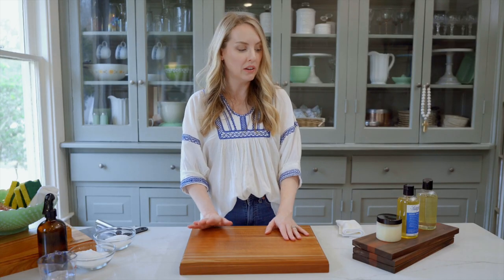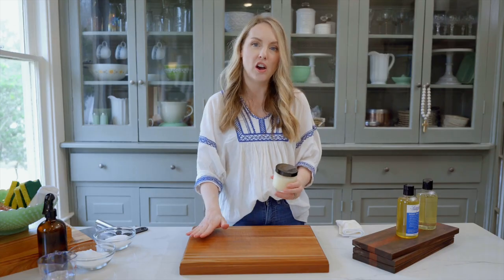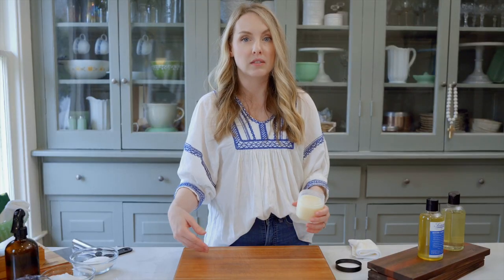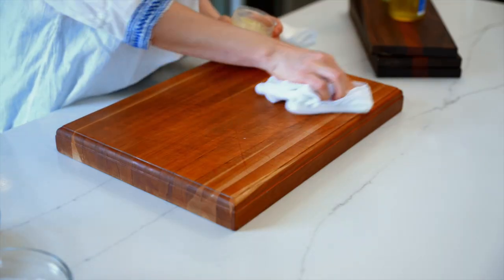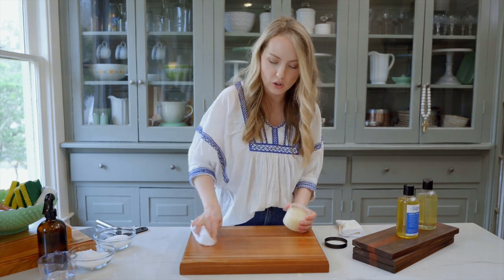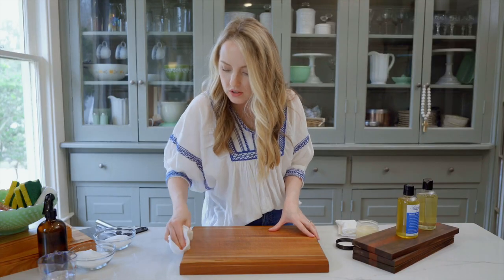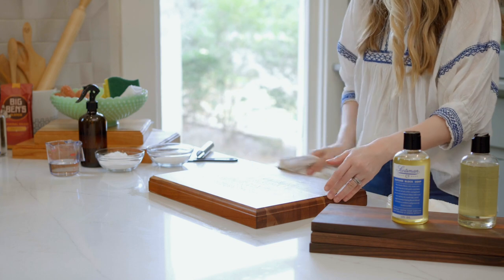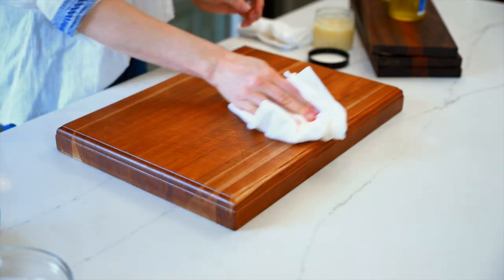Once it has soaked in for a little while, we're gonna apply a little bit of wax. The wax helps create a protective layer on top. The friction of rubbing the wax on here will kind of melt it and help you get a really thin, even layer, and then it will harden back up which helps protect your board even more. Scrape out a little of the wax and start buffing it on your board — you want to make sure you get in all the little grooves. The wax will also help to fill any other scratches that you didn't quite get sanded out so that you have a good, even cutting surface. Once I've got all the edges, all the routing, the surface — everything waxed really well — I'm gonna use a clean spot of my cloth and just buff it out one more time to make sure I remove any excess.